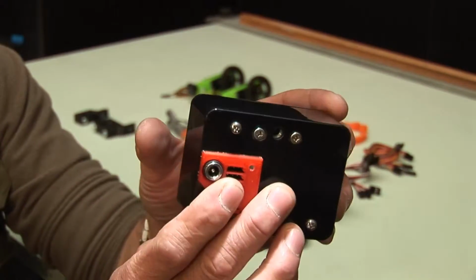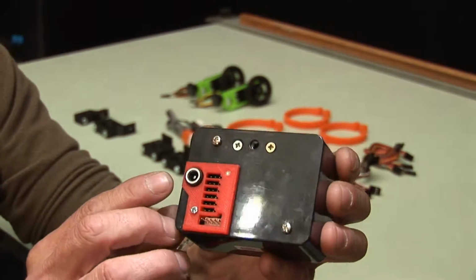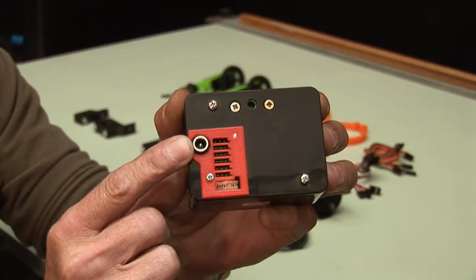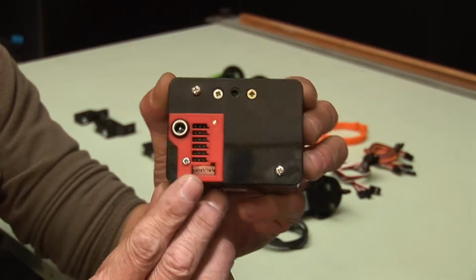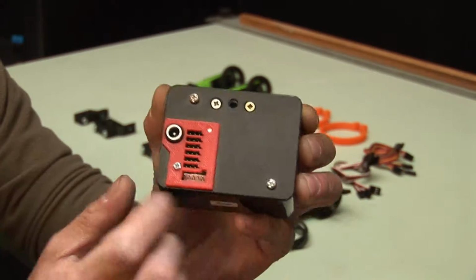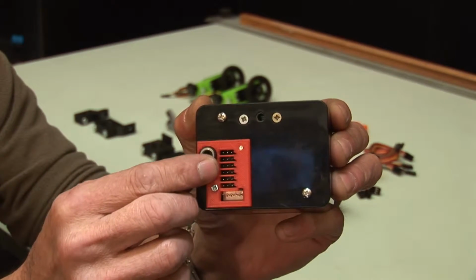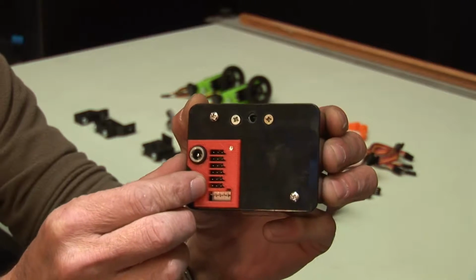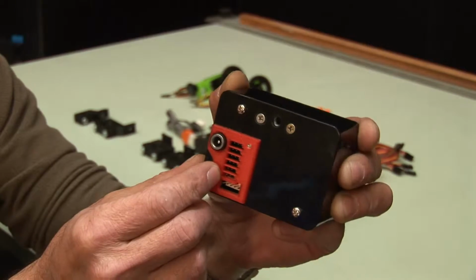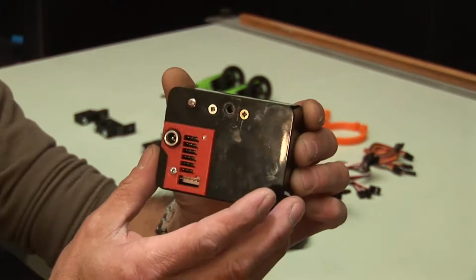indicate different system states. Having a look round the back, we have a concentric power socket here, that's 7 to 24 volts input. We have a socket here which connects to the joystick control, which is part of the kit there. And we have 6 control outputs here for controlling servo motors and control signals to a gimbal stabilizer for controlling the pan, tilt and roll.